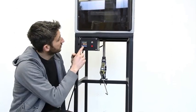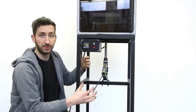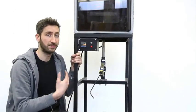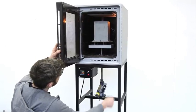We're going to turn it on and set the right temperature. Once the plastic melts we're going to apply pressure to squeeze everything together. This is a relatively slow process and it totally depends on the type of plastic you use and the size of your object — how much pressure you need and how long it takes.